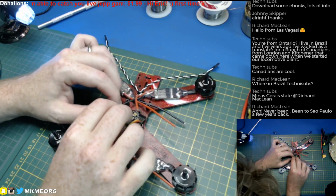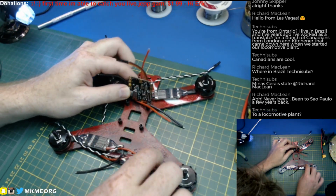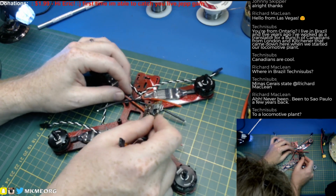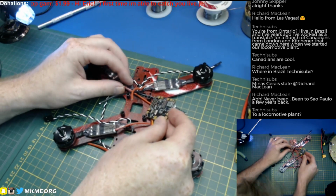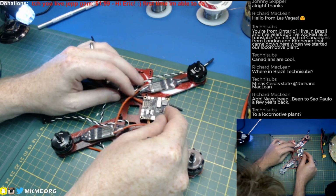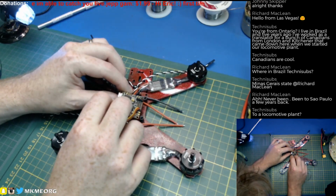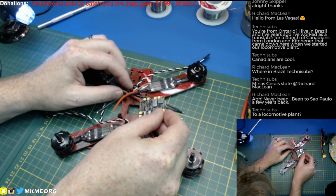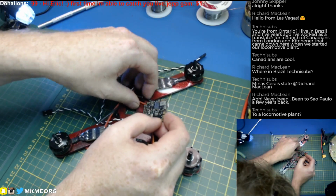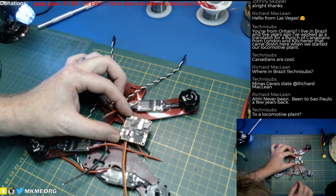We'll solder them up, and then what I can do is, if we come directly in, then we can only flip backwards, and then we need to leave way too much from the back side. That would be annoying. So I think what we'll do is solder enough that we can flip the board over this way. This is the trick to building a quad, is really just take some time. In my experience, I'm not a pro here, Paul can speak up, but thinking ahead, because you will have to service this. If we solder the wires where it's just a bear to get at them, and you can't flip this over and service the bottom of the board, solder a speed control on later when one goes bad, it's just no fun. So a little bit of forethought here will go a long way, and I think we'll just plan to flip it like that.